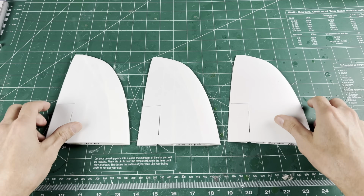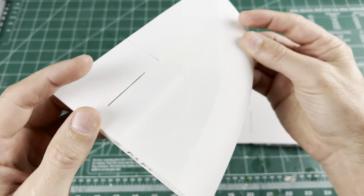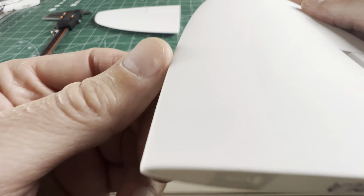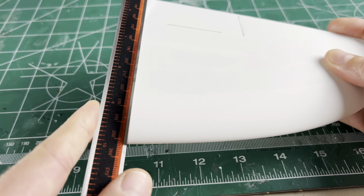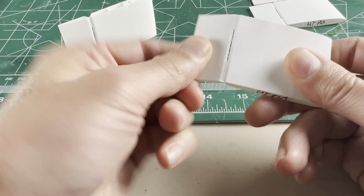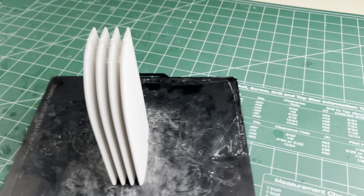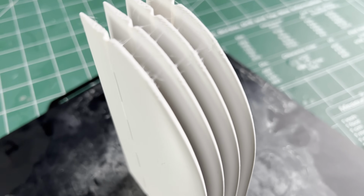Next up is surface finish. A quick look at the overture parts. Not perfect, but very nice. Surface quality of the high temperature PLA is amazing, but pretty much identical to the regular PLA. Almost impossible to tell apart. Bridging is identical. Zero warping on the bed surface. And hinges just like PLA Pro. And lastly, the high temp PLA did have some wisps when printing multiple parts, but not too bad.